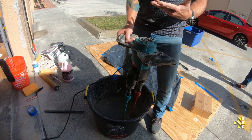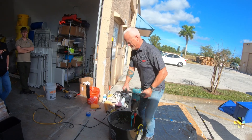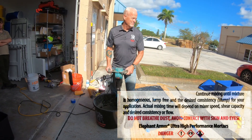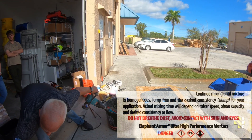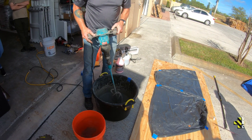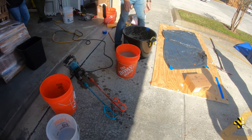A technique on a drill like this — with a powerful drill, if I turn my drill this way and hit into the wall, I can actually break through it. So I always want to keep my drill straight up and down, working around the outside. The reason you want these flat-bottom buckets is they're flat on the bottom — you're not going to have any dry powder in the crevice. I always want to have my mixing bucket and my washout bucket close to me. I drop the blade in the bucket, spin it — and I don't have to worry about cleaning my blades. If you dump it and it dries, you'll snap the gears in the drill — that's how strong it'll be.